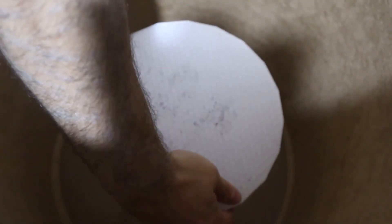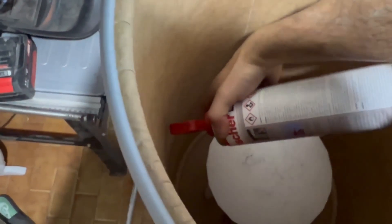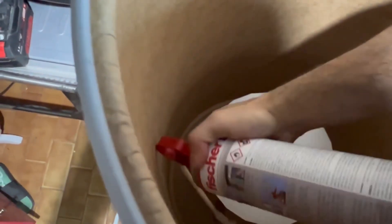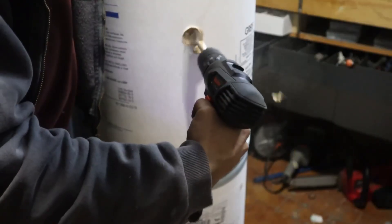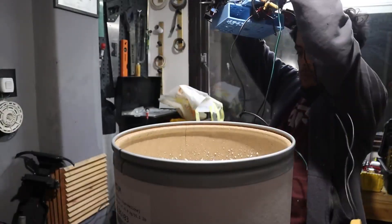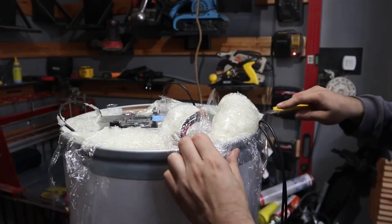Now I had a structure that's a good size for my lightsaber. First, I had to figure out how to put the laser in the upper tip, so I printed a base that rested at the bottom of the drum and ended up at the perfect height to support the laser. To make it less fragile, I filled all the side spaces with polyurethane foam — a foam that you pour in liquid form and it expands, sealing everything. I also made a hole on the side to install a button to turn the laser on and off, like the activator. Then I mounted the laser on the tip and used more foam to seal the gaps, so it's secure, centered, and stays in place.